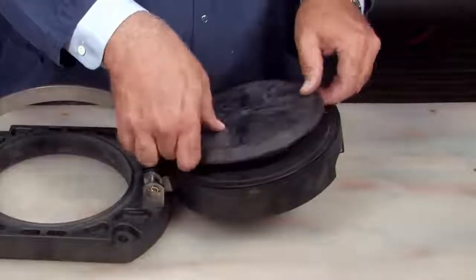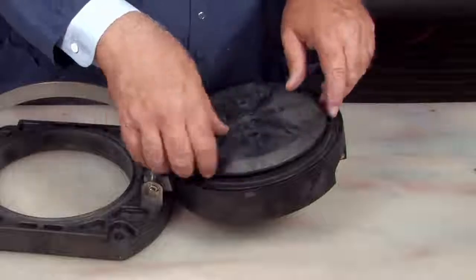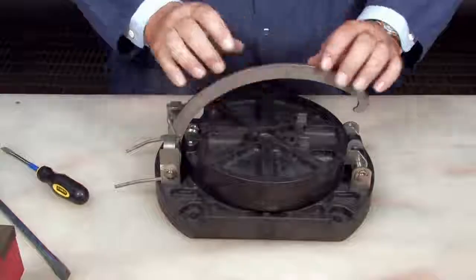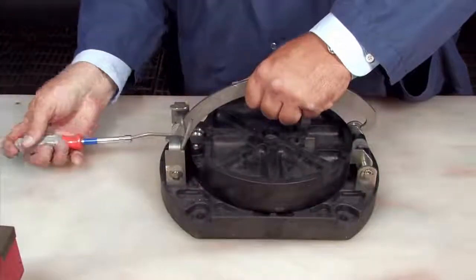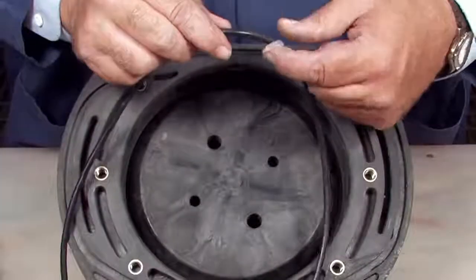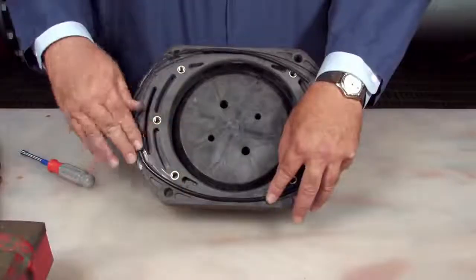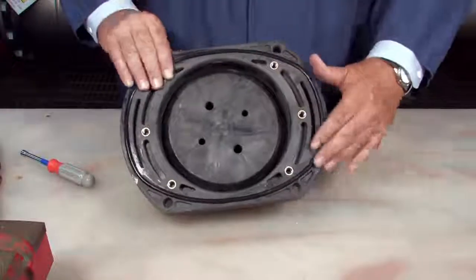Re-thread the retainer plate and tighten. With the check cleaned and repaired, replace the torsion springs. Prepare the checks for reinstallation by cleaning the O-ring groove and thoroughly lubricating the O-ring with an FDA approved lubricant. The lubricant should help to keep the O-ring in place during reinstallation.